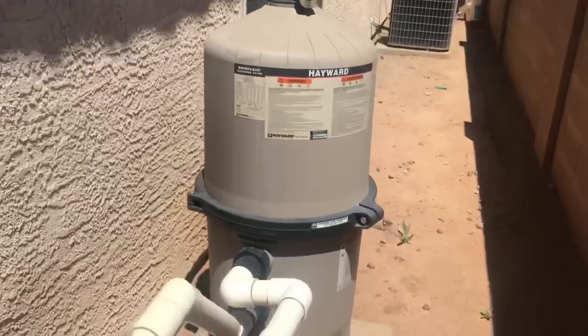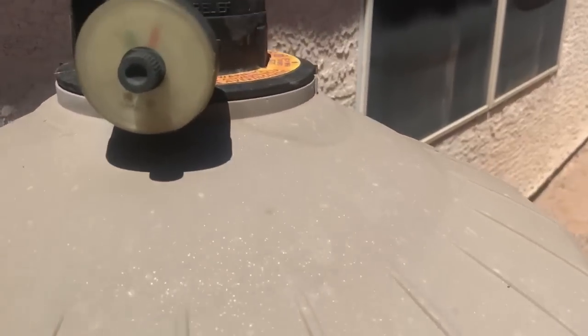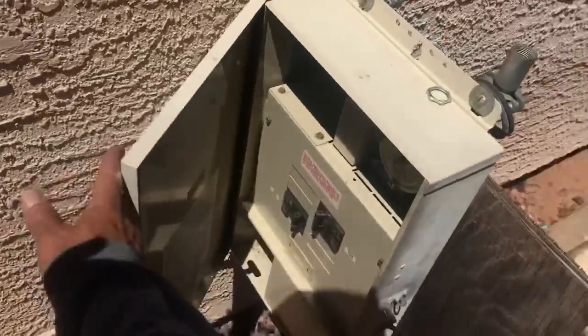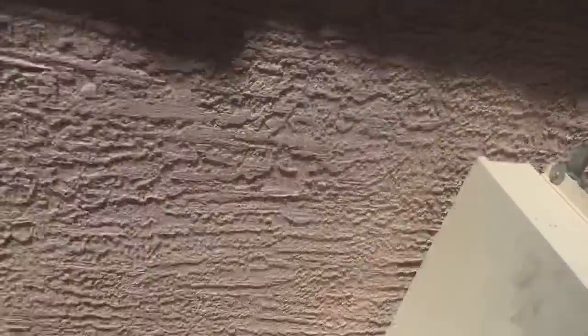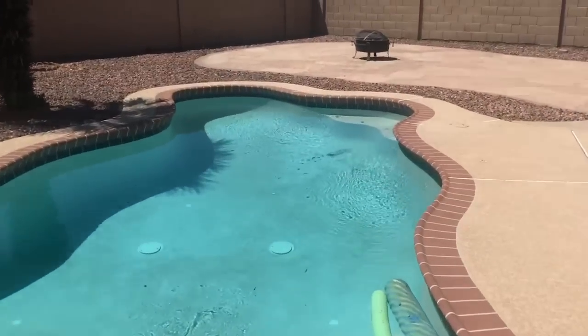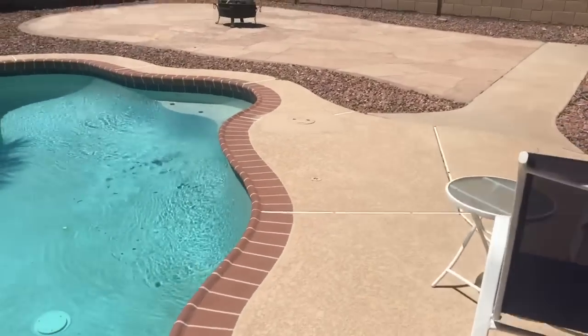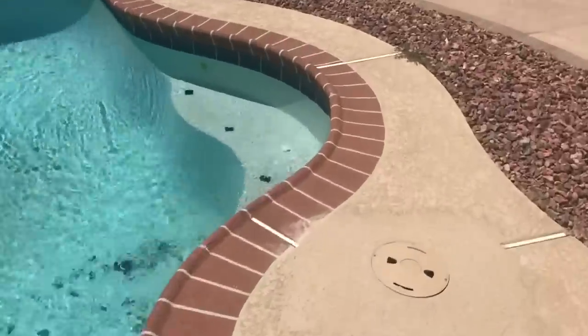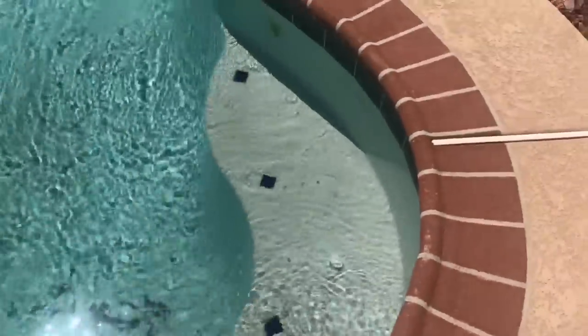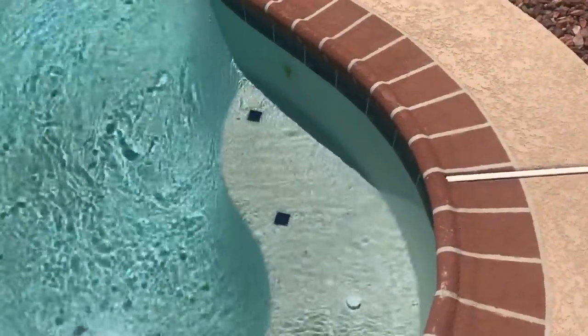I don't know if you can see that — the needle is in the green but also touching red. So if this reading is accurate, the pressure should be okay. For whatever reason, these pop-up heads are not getting enough pressure in my opinion. You can see the water moving a little bit — it's not too bad. And you see the water moving on those steps. But there's some dirt in different areas, and that head's probably not ratcheting around when it goes down. There's also a little bit of algae on the wall that I'll take care of when I service this pool.